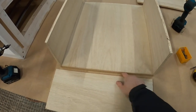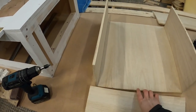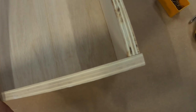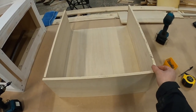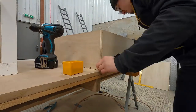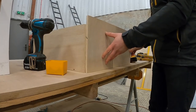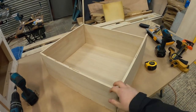We're going to start by screwing it at the bottom. Because the correct width is there, we're going to have to pull these sides out ever so slightly to where they match up, because currently it all lines up at the base. But there's ever so slightly a bit either side where the top edge is leaning in towards the centre of the box. We'll screw along the bottom and then pull these out to where we want them and screw into the sides as well. We'll repeat that exact same process to install the front piece, and then we'll have our finished drawer.